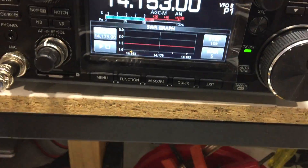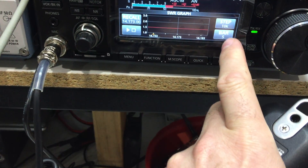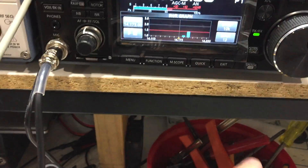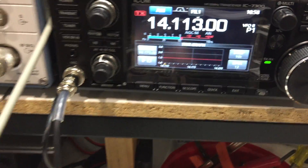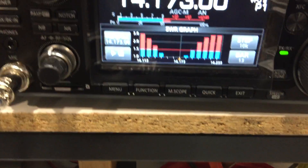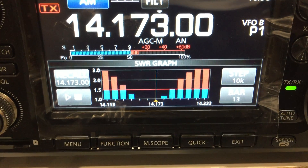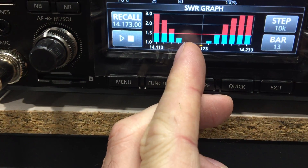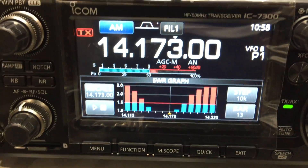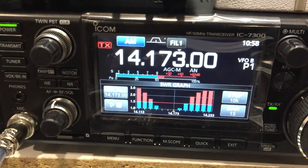We'll use the inbuilt one and I'll show you how that works. I've got 13 bars at 10 kilohertz steps — here we go. It just shows you where this antenna is centered on, and each bar is 10 kilohertz, so 10, 20, 30, 40 — you might say 50 to 60 kilohertz wide — which gels with the spectrum analyzer's or vector analyzer's analysis of that.